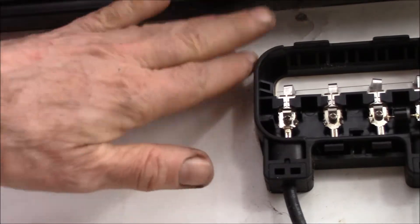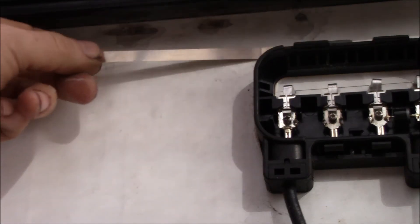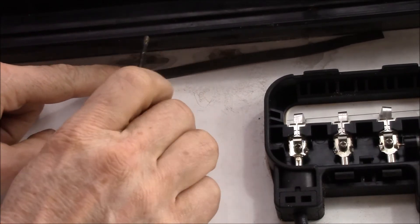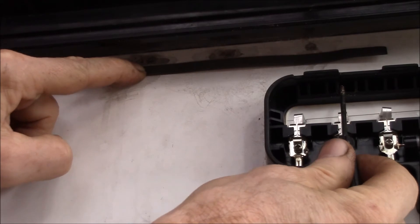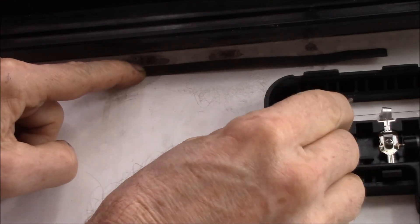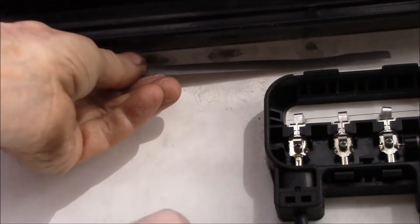Okay, here we are on the back side of the panel. I need to get all my sanding done and expose these other two tabs — I've got them just barely peeking out but need to go a little farther. The idea is to take another nickel strip, bend these tabs back, and solder them onto this nickel strip — one, two, and three — run that over here, then drill a small hole right up there and run a 12 or 14 gauge wire up to pick that strip up, then solder it onto this tab. This tab is connected to the bus bar, and the strip will be connected to the string of solar cells, which should connect everything back together.